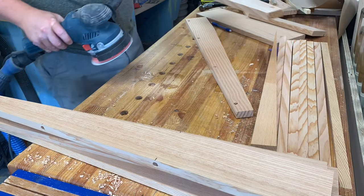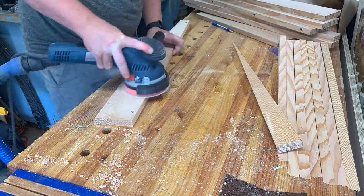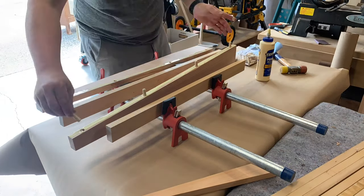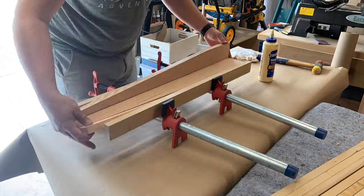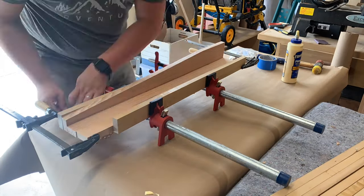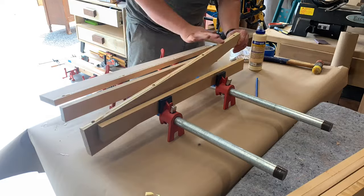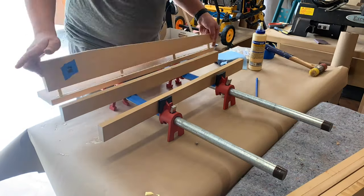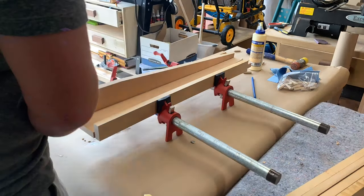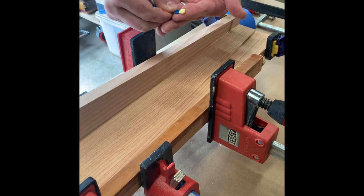Once you got all your holes drilled, you want to sand it. I'm sanding because this was some pre-finished stuff - I want to make sure that I have raw wood for the glue to adhere, but also you might have some chip-out from drilling. It helps to sand ahead of time before assembly. Once they're sanded, it is time to glue. Use plenty of glue, throw in your dowels, lots of glue as well. You can see I'm using those off-cuts - those tapered leg off-cuts - so I can still have that perfect clamping pressure. If you have enough glue, you should have a good healthy squeeze-out - that's a good sign. A great little trick to take care of squeeze-out on the inside is a plastic straw. It just contours to that angle and fits perfectly, and there goes the glue. You'll still have a little bit of cleanup and sanding, but that trick works great.